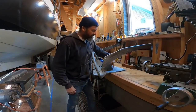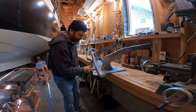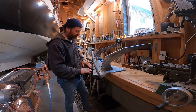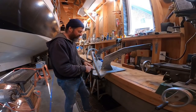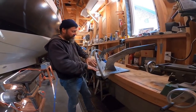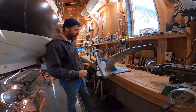I may have weakened the toe of the anchor with the holes. Also, this grind that I had to make before the flukes could be turned down actually weakened the fluke as well. To my eye, it's not a huge structural thing, but there's no question that I changed the structure of the entire fluke. Made me have more of a tendency to sort of unfold.